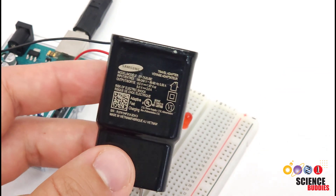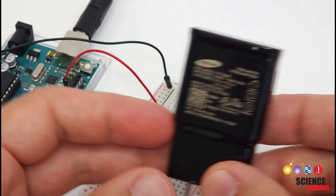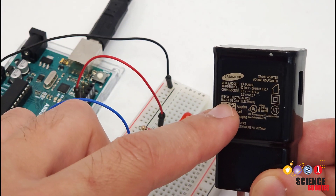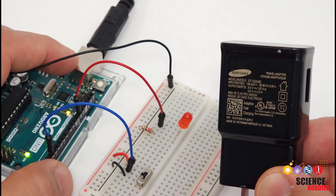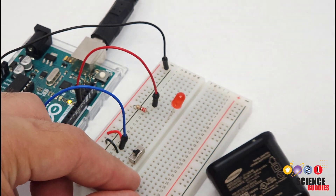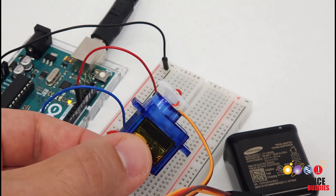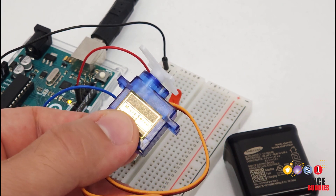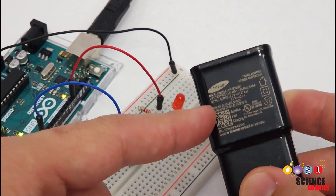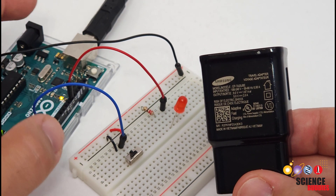However, this is where we need to be a little careful and start talking about current. If you look very closely at this charger, you will see that it is rated for an output of 5 volts and 2 amps. However, that does not mean that if I plug a USB cable into this charger and then plug in my Arduino, I can get 2 amps out of my Arduino. The Uno R3 has a 500 milliamp — so that's half an amp — fuse connected to the USB port. So that 500 milliamps is more than enough when you're using tiny parts like LEDs that only draw about 20 milliamps each, or maybe a single small motor that might draw 100 or 200 milliamps. But if you are going to try and build a project with lots of motors, that 500 milliamps is not enough. You cannot just take a tablet charger rated at 3 or 4 amps and assume that will give you enough current through the Arduino, because you're still going to be limited by the fuse on the USB port.